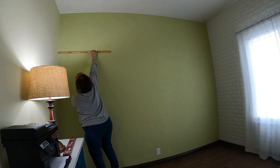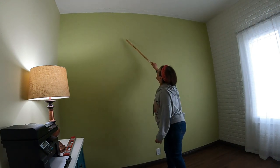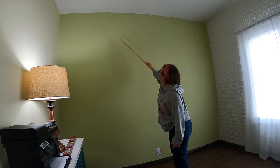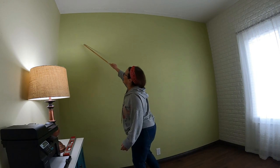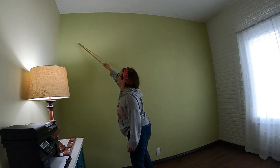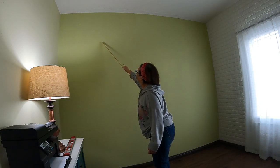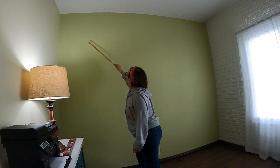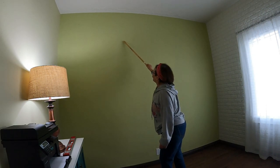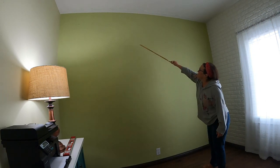So this first bracket is spaced a little bit more than 14 inches from the side, 32 inches, skipping one of the studs. Each stud is 16 inch on center. That's the typical building code. So there's a stud here. There's actually a stud here, 16 inches away, center to center. I'm just using every second stud. So from here to the next one is 32 inches on center, skipping this stud, 32 inches from that one.